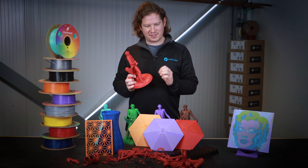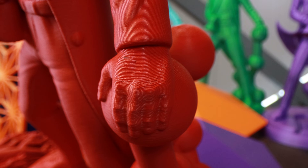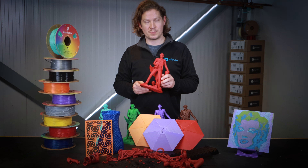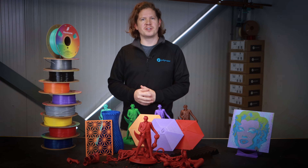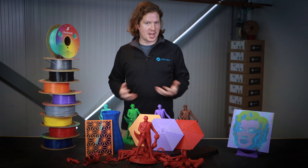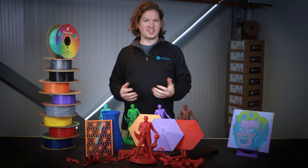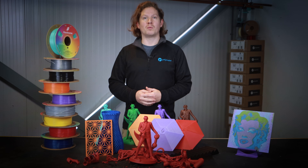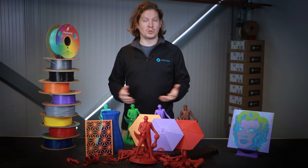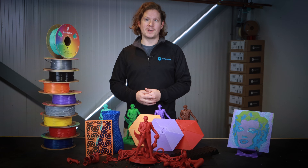There's just a little bit of something there, but it's enough that you can flick it away after. Overall, pretty successful as a support material using Co-PE with Polyterra PLA. So why should you choose Co-PE when it seems exactly the same as PLA and you're already very happy with PLA? Being polyester-based means we can significantly lower the price of raw materials, as polyesters are one of the most commonly produced plastics worldwide. So you can enjoy PLA results with better than PLA prices.